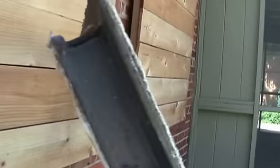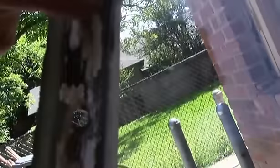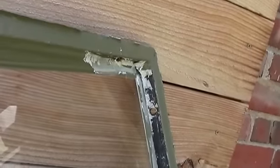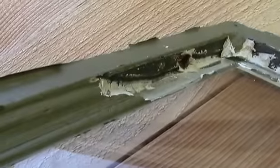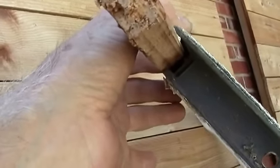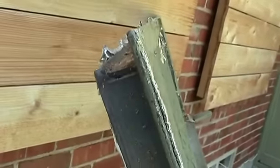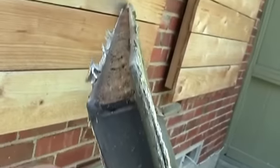Now that I've got this window out, there's holes in here where they run screws. You have to knock out all the glazing to get to the screws. Before they put these windows in, they screw this lumber around it, and that's what they use to nail it to the framing. You can't just take the screws out and knock the window out because you have that ridge there. You could take a big sledgehammer and knock it out, but then you've got a huge mess. It's easier just to cut around it like what we've done here.